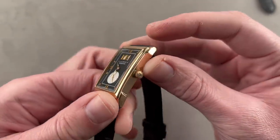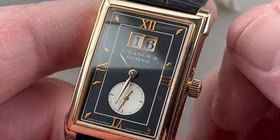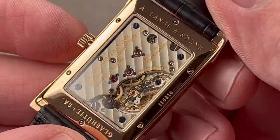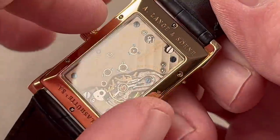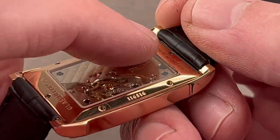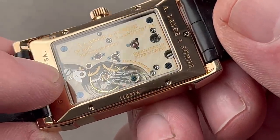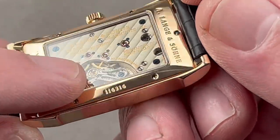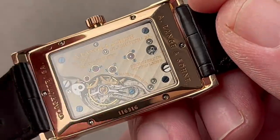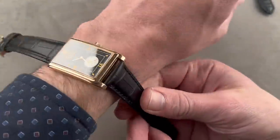It's 26.6 millimeters from side to side, and then from lug to lug it's 42.7 millimeters. This one's in rose gold. As with most Lange watches, it features a dial made of sterling silver that's then galvanized black. On the reverse side, you can see the movement beautifully made — caliber 931, 42-hour manual wind power reserve, German silver bridges and plates, freehand engraved balance cock. We have both black polished screws and fired blue screws, and the details matter. The anglage is broad, mirrored, and hand-laid. We have a black polished cap for the escape wheel. And then we have a black polished swan's neck fine adjustment system on that freehand engraved balance cock. Glashütte stripes, jewels set in chaton — an old-fashioned way of making watches that dates back to the pocket watch era of watchmaking in Glashütte, used here as tribute to their heritage.